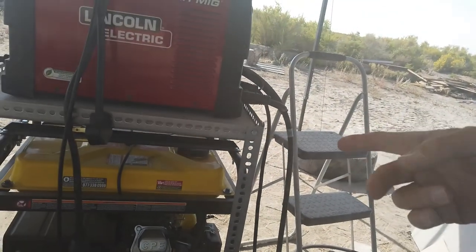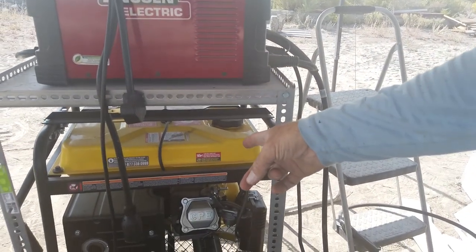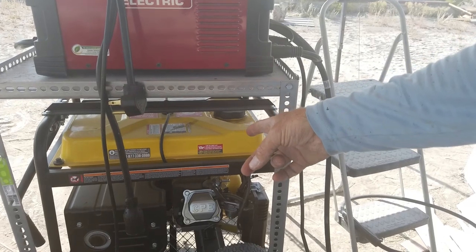Hopefully I'll get that video done in the next couple of months. The welder runs on 120 volts, so you can run a 10 or 12 gauge power cord out to your work site or just use a generator like I'm using — this is a 3500 watt generator. My buddy actually used his little $200 Lincoln welder on this same generator for some of his projects, and it runs that little welder fine.